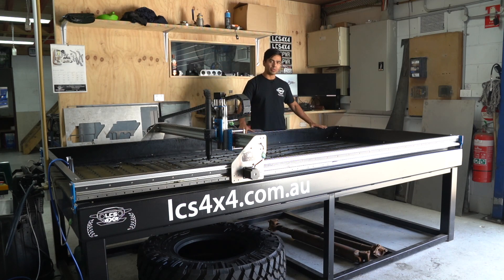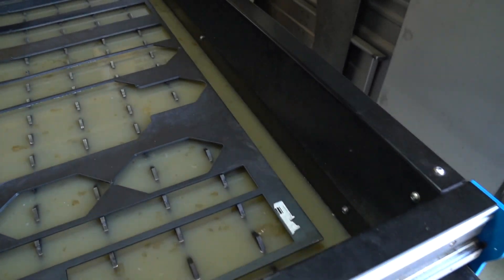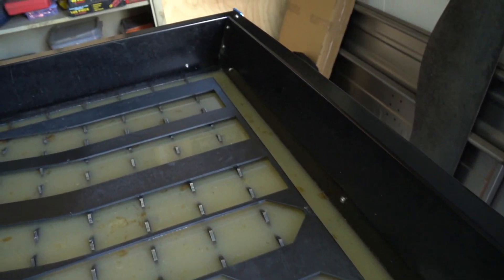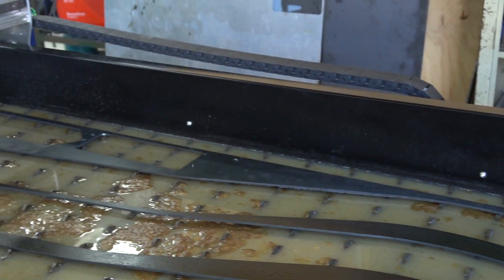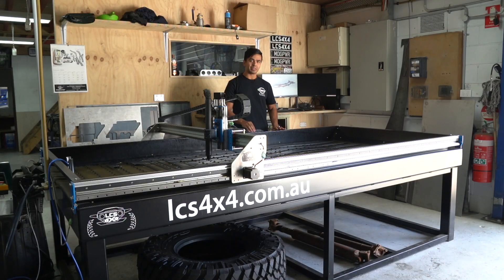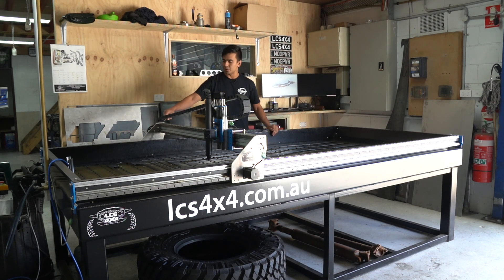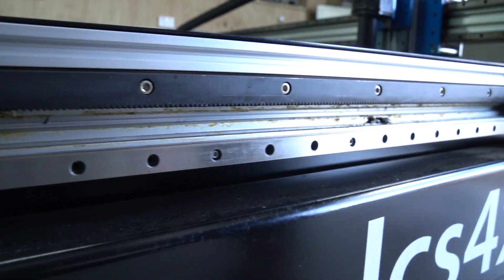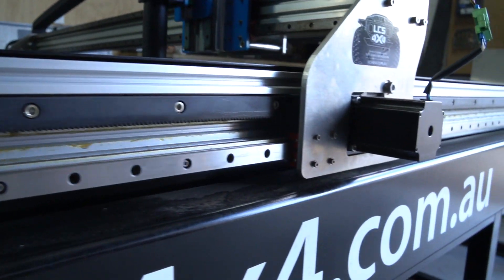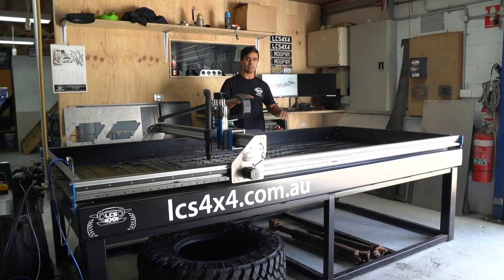Laurie and I designed all these shrouds in CAD. You don't have to have them, but they really do stop spray from the water going everywhere, as well as dross spraying outside the waterbed. These are laser cut and CNC folded pieces, 3,000mm in length on the long side, and they really do take the look of the table to the next level. These pieces also protect the gantry rails and make sure they don't get clogged up as the machine's moving backwards and forwards. The shrouds are also a safety feature for when you're unloading and loading sheets, just to make sure you don't damage the machine rails.